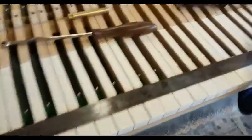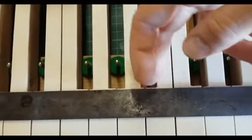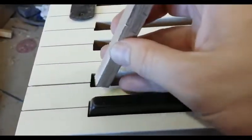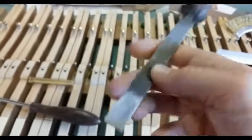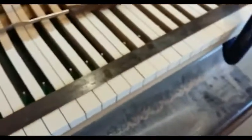Another stage of the key-top process — I've got a clamp going along there so I can get the edges of the back absolutely flush with each other. You can see I've been filing them in a nice straight line so all of them are absolutely identical. I use a stick to get the worst off at an angle, because they actually go back at that kind of angle at the back of the key. Then once I'm close I've got a file that's tapered on either end, so I'm guaranteed to get a nice sharp corner when doing the fine work.